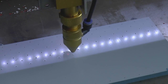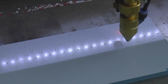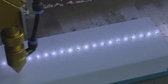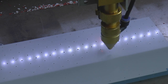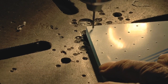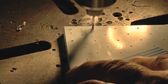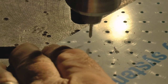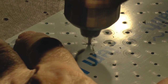This is undoubtedly quicker than marking it out by hand. I've put all the pilot holes in now. I shall be drilling those out to two millimeter diameter, but I suspect they'll go undersize and I'll have to put a two millimeter reamer through. Still a lot of holes to drill. You really could do with something like a 2.05 drill, because now I've got to go around and open all the holes up very slightly with a two mil reamer.